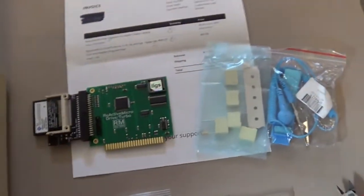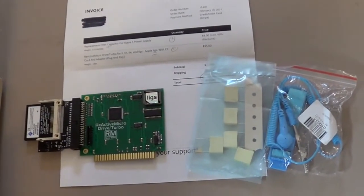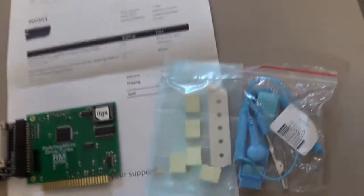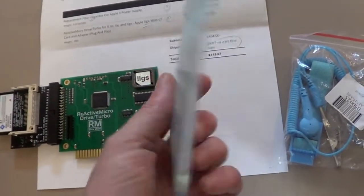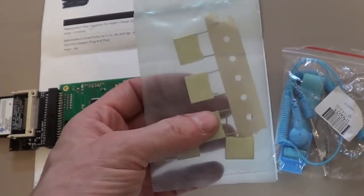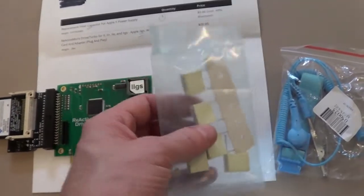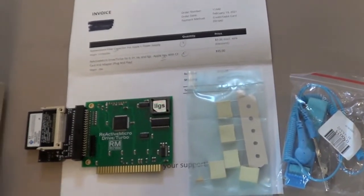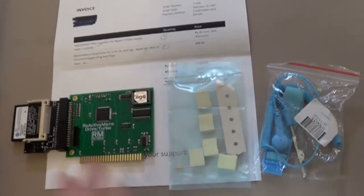Another thing I've been reading a lot about, the Apple II was built really, really well, but one flaw, and it's a ticking time bomb. I thought, oh boy, I better get that taken care of. There is one capacitor on the power supply, and when that sucker blows, it really makes a stink in your house. And I took mine apart, and you can see it's starting to expand and starting to get cracks in it. That's a sign you better get them changed.